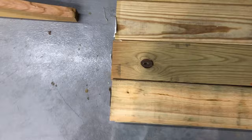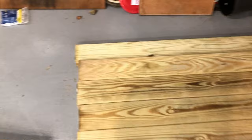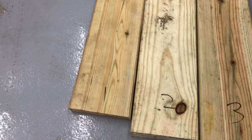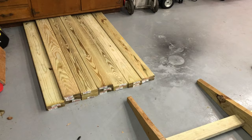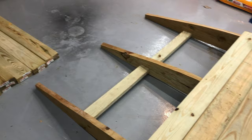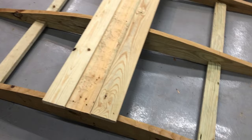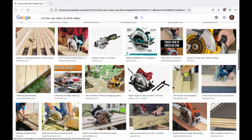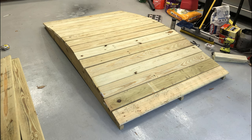After you cut everything, I grouped all the pieces by average length. I couldn't get everything exactly the right size due to the varying lengths, but I just grouped them all and scrapped the longest and shortest pieces so that when you laid them out on the stringers, you're not going to have a jagged bridge. I just marked each group by number — group one, group two, and so forth. Then while you're screwing down the deck boards, you would just alternate: one piece from group one, one piece from group two, and so forth. If you're really worried about the jaggedness of the sides, a lot of people do this when they build decks — you can just take the circular saw and square everything up after it's done.